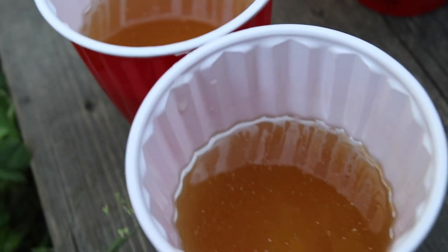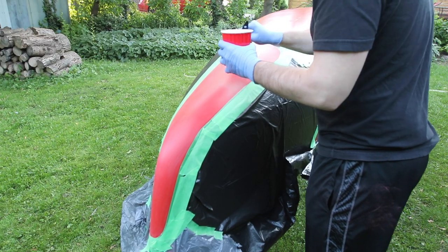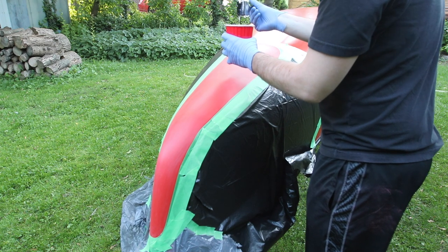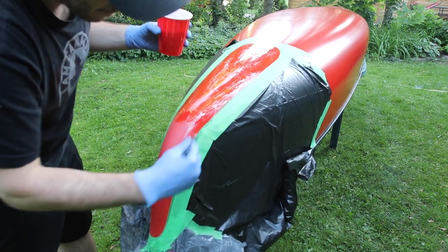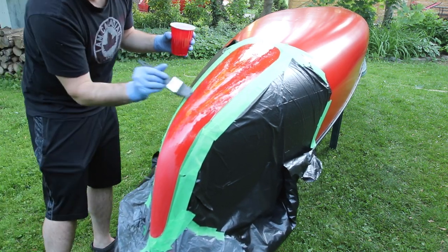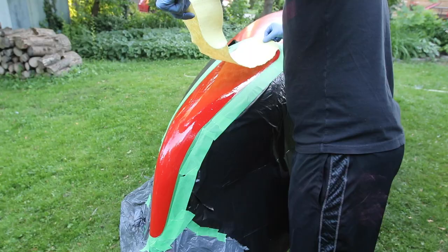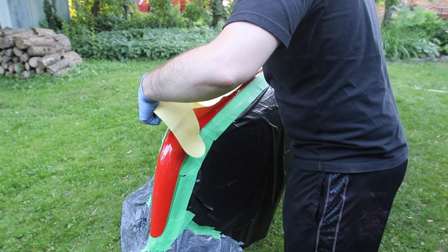When applying the epoxy, you want to work as quickly as possible. I started by applying a thick layer to the boat before placing the patch on top. This helped ensure that there was a good base of epoxy under the patch before I placed it down. I know other people that use larger buckets and actually dunk the entire patch into the epoxy before applying it to the boat. I think either method works.